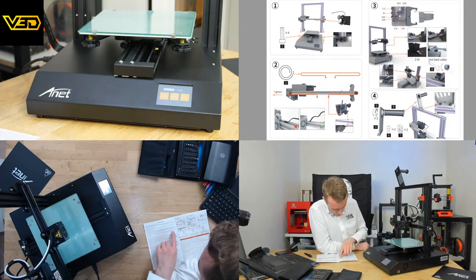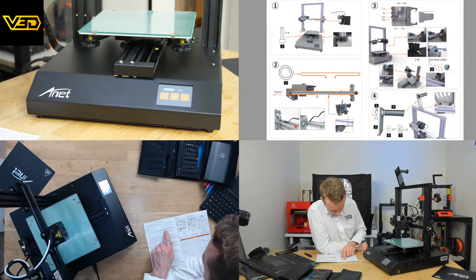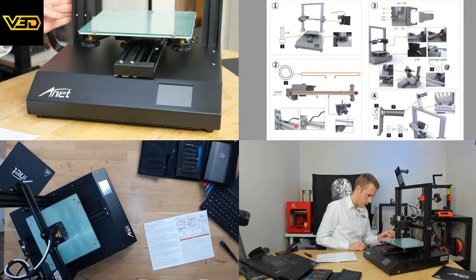After assembling the machine, see, it's in a weird order. The first thing in here says printing process for the first print. But really, you should probably start with leveling preparation. After assembling the machine, tighten the vertical rods on left by hand. Tighten the vertical rods on left by hand with the printer power off. Horizontally, observe the distance between the build plate and nozzle, making sure that there is a small gap between the tip of the nozzle and the top of the build plate for you to place a piece of A4 paper in between them. Make the sensor head about 2 to 3 millimeters away from the platform, slightly higher than the thickness of the ruler. Okie dokie. So it actually says turn it off. We can turn this by hand.